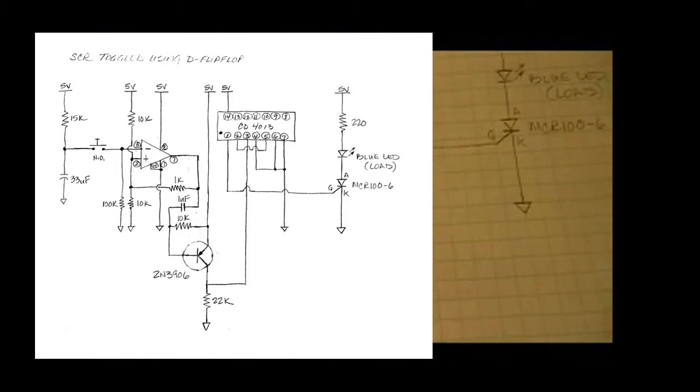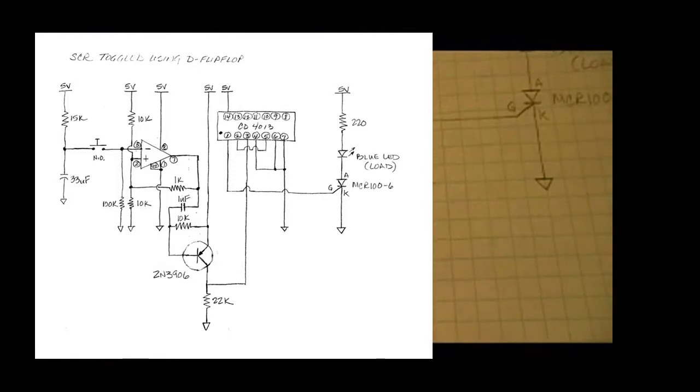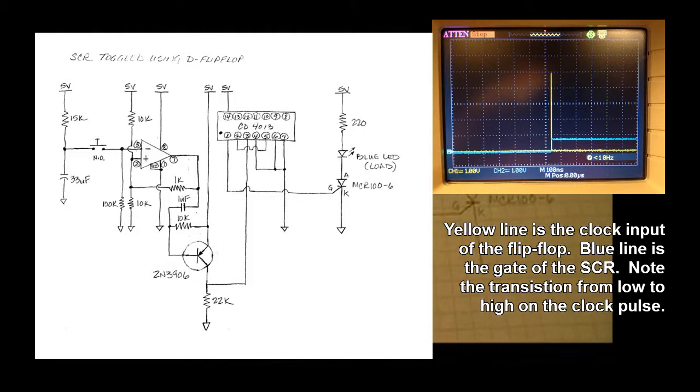So then when that transistor turns on, it takes pin 3, the clock of the CD4013, high. It is a positive-going signal, that clock increment, that causes the flip-flop to flip. So it's every positive-going clock cycle. Initially, the 22k ohm resistor is pulling that pin low, so that when the transistor turns on, that pin suddenly goes high and then back low. So you get that clock pulse, a very quick pulse, which is all we need.